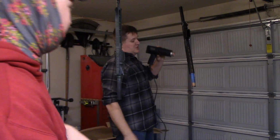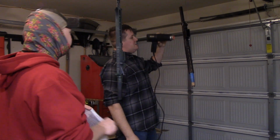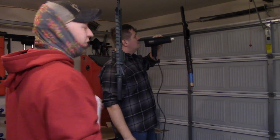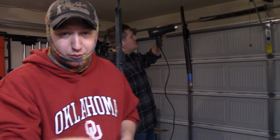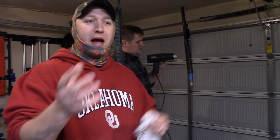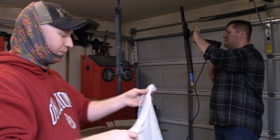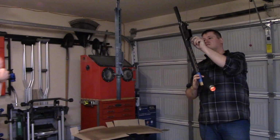That's actually a good point. I probably will just do it quick. I won't soak it like I did before, but I'll do a dusting of it again. Yeah. So that is also, for those of you that are familiar with Cerakote, why in the instructions it tells you, after you do your acetone bath or brake clean bath, whatever, and you sandblast it, you're supposed to bake it, because it helps open the pores up and it draws that excess oil out. And then you repeat the process. So that's why.